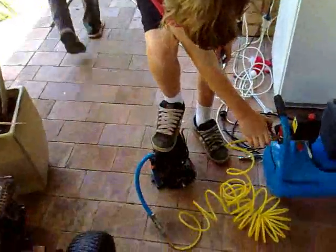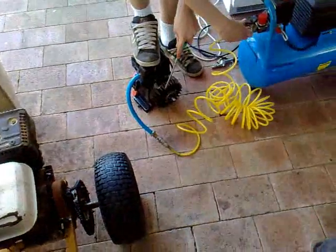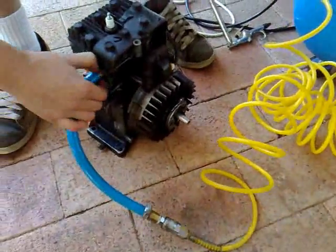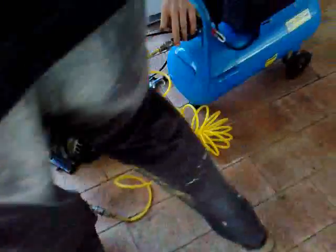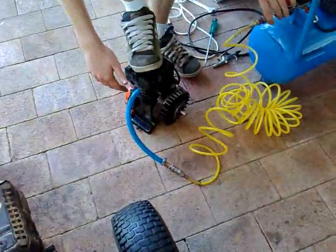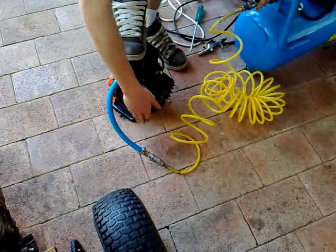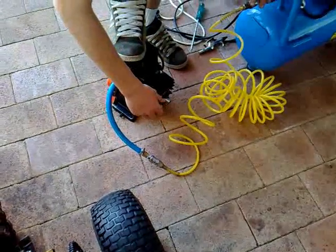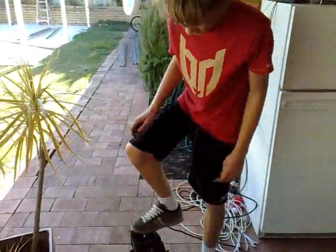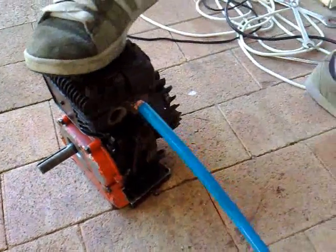This is the first trial of the air engine. There's too much of an air leak around there — air is coming out of there. I'll just put a gasket on here and some plumber's tape. Alrighty, the air engine wasn't going before but I've just put a gasket on here and some plumber's tape, and now I'll show you how it goes.